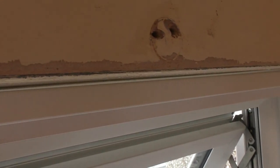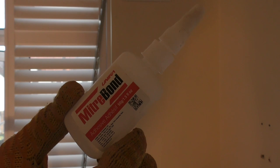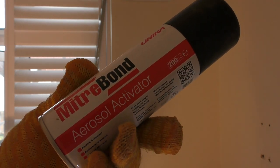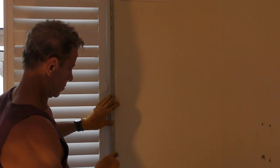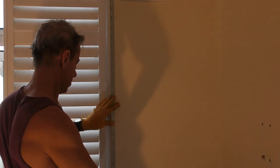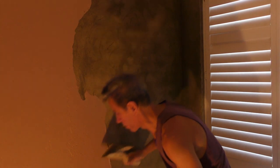That just allows enough room for the finish to go up against that bead. It does stick out a bit in this corner which is why I'm putting a new bead on there. This was actually the first time I'd used this mitre bond - I'm going to use it quite a lot now because it is quick when you're just sticking a bead to something like this. It's just nice in this situation where all your beads are basically set, so any finish that you put on, your bead's not going to move. Just got to make sure you're putting it on level.